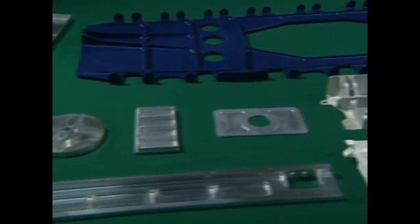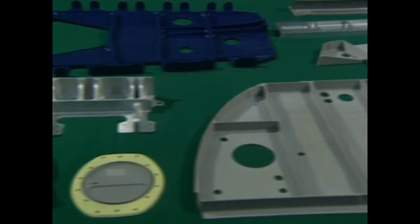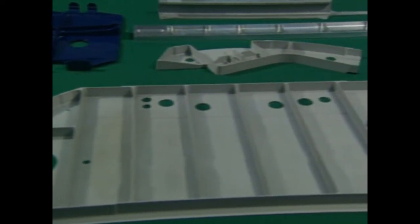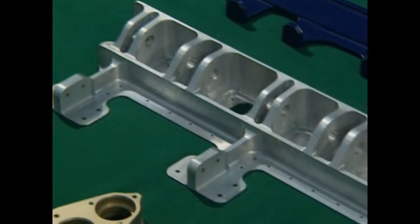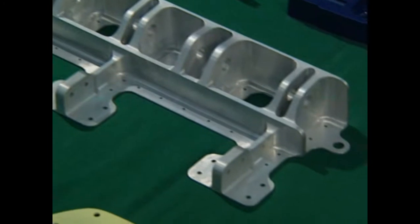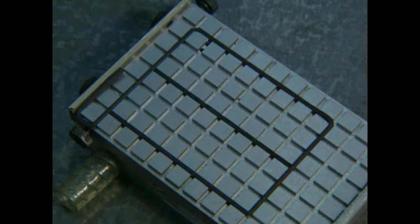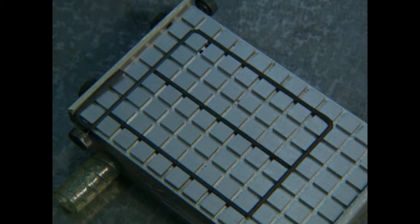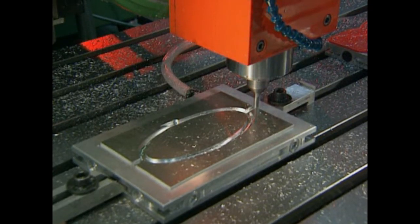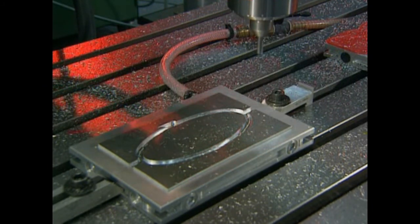Many components, especially those used in the automotive and aerospace industries, need to be completely machined or profiled all the way round and through. They can be held down with clamps, but that entails additional settings and machining only half the component at a time. Instead, double-sided tape or a vacuum plate with rubber seals is used, which is still less than ideal because it entails long and laborious laying up. But the real problem occurs when the component needs to be profiled and machined right through.